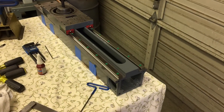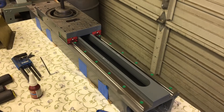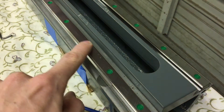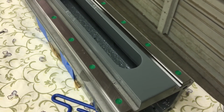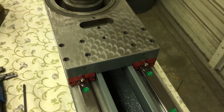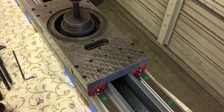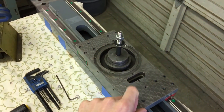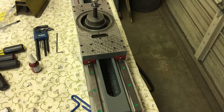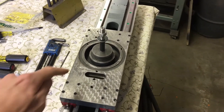The column is all painted and the rails have been aligned, installed, and torqued. I even got to put the green caps in — it's really a milestone. I was really looking forward to that. It's a smooth operator for sure — got a nice firm preload. The next step on this is to pull it back off and start getting the screw and whatnot in there. Not really much work left on this part.